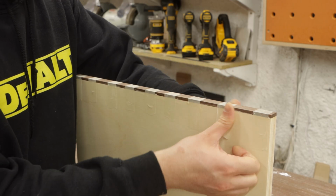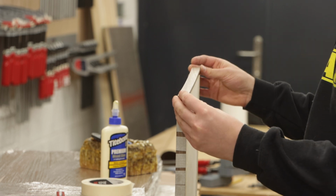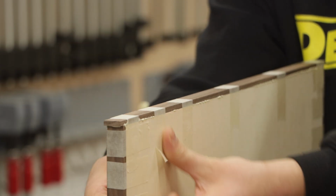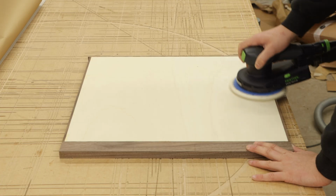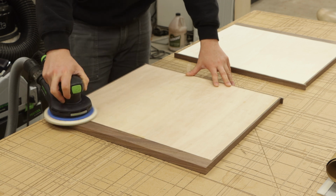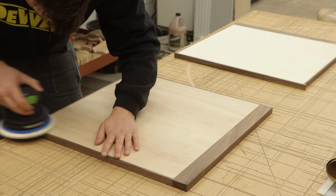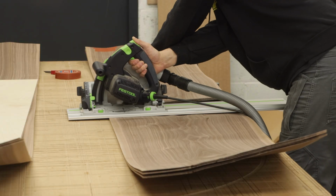The cabinet is made from birch plywood with American black walnut constructional veneer and American black walnut solid wood. For this design, I had to veneer it as the legs were really airy and lightweight, and the enclosed section on the bottom had panels going in different directions, so it wouldn't really be possible in solid wood as there would be too much movement to contend with.